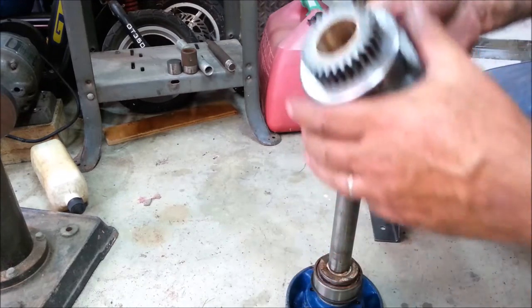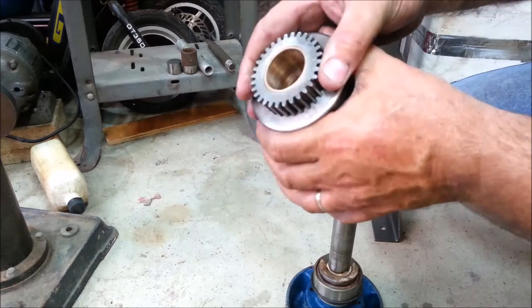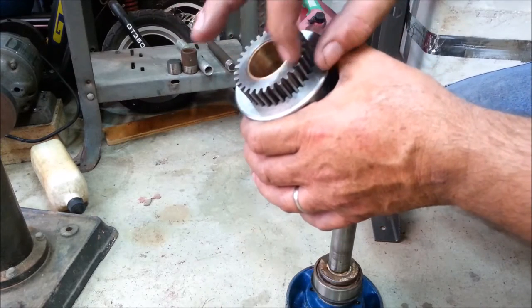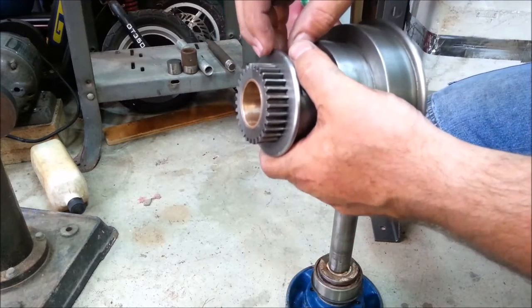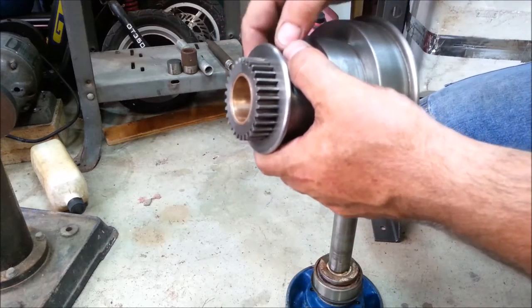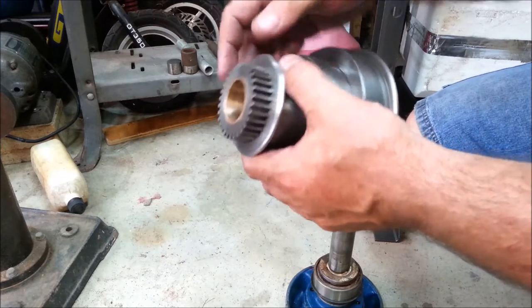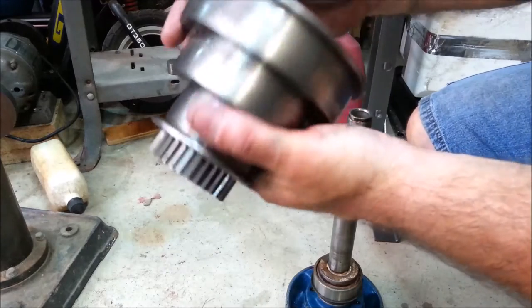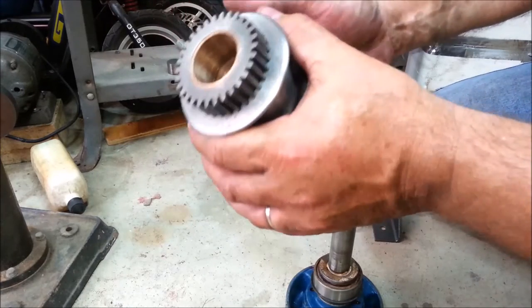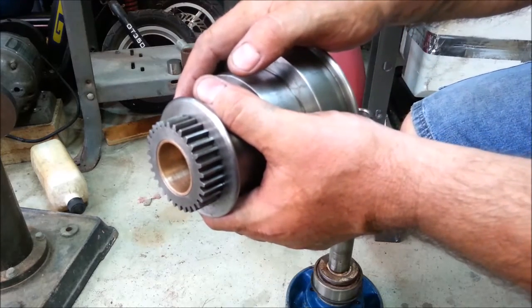So there's the results of making my own reamer — taking the gear for the 9-inch, I bored it for the bushing, and I made a sleeve out of the bad gear to increase the diameter of the stem large enough so it would all press in here. I was able to get this rebuilt. Now I can begin to put the Wards Logan lathe back together.